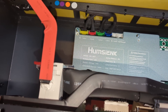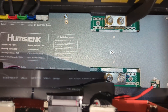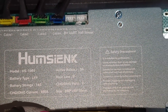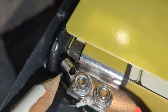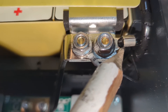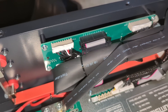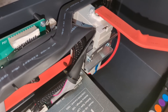They must be custom bus bars and they have heat shrink wrap on top of them. Same thing for the negative side. I was not expecting bus bars at this price point, and it looks like it's also a custom BMS. There's a temperature sensor on the positive terminal and another temperature sensor at the negative terminal. The bus bars link the battery terminals together continuously. I think those bus bars are a top pick for me in this battery.